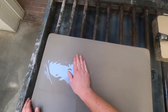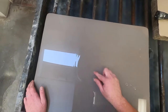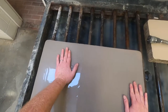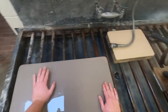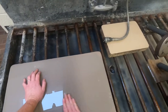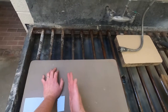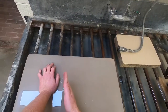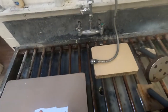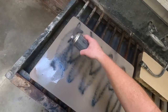These scratches — whenever you see these little 'Nancy Kerrigans' or 'Tonya Hardings,' whatever you want to call them — the little circular marks you'd see on an ice rink — you need to remove those before you move on to the next grit. That happened with 80 grit so I'll have to continue with 80 until it's gone. Sometimes if you have a deep one you could be close to finished polishing and might have to go back a grit to remove it from a crucial area.